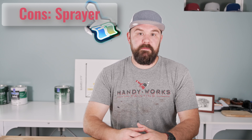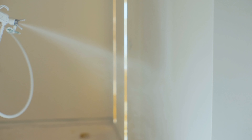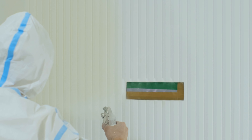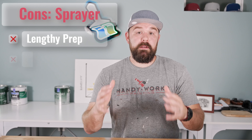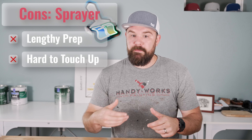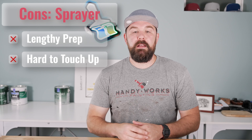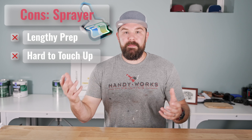The downside of using a sprayer is that it requires the most time for prep. A lot of times people aren't taking into consideration how much time it takes to prep the room or space you're using. Particularly with an airless sprayer, you get a ton of particulate in the air, so you need to tape off everything, including vents, and wear a respirator. Another big con is that a sprayed finish is the hardest to touch up. If something happened to the door and you had to go back, it's really hard to match that texture with a roller or any other method — a big downside particularly for homeowner DIYers.